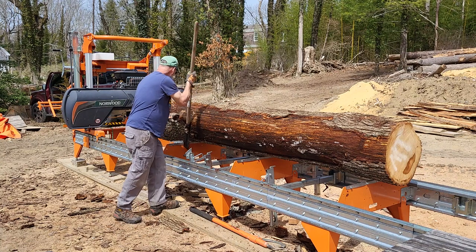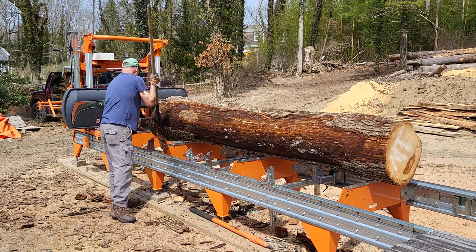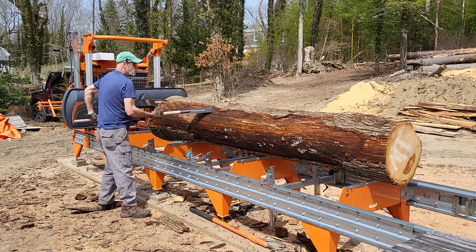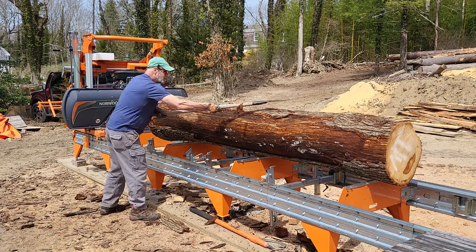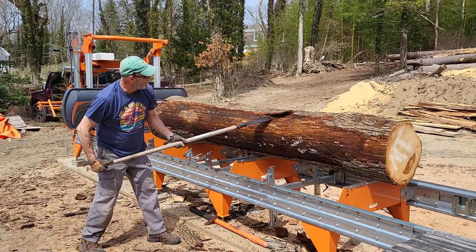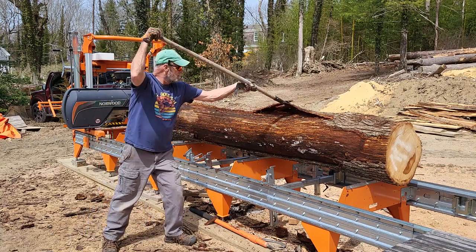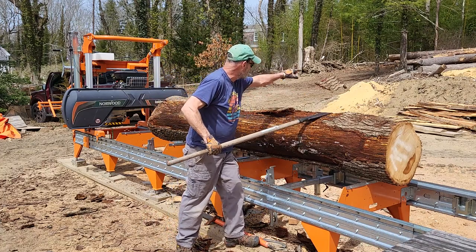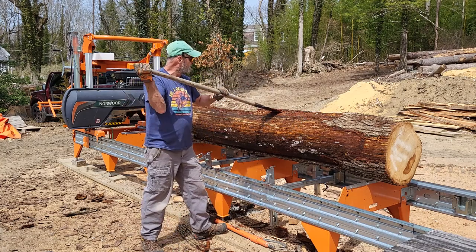You only do that with a big slick when you're finishing the mortise off, or when you're finishing off the edge of a tenon. To clean out waste, you run bevel down with an angle. And if you do that, you can go along pretty quick because the chisel won't dig in. And also you run bevel down if you don't have a chisel that's long enough to reference across to be able to use the flat part of the chisel, which is a reference surface.